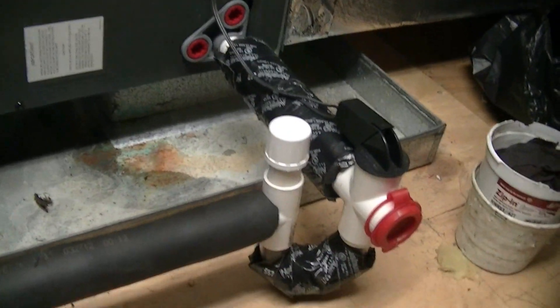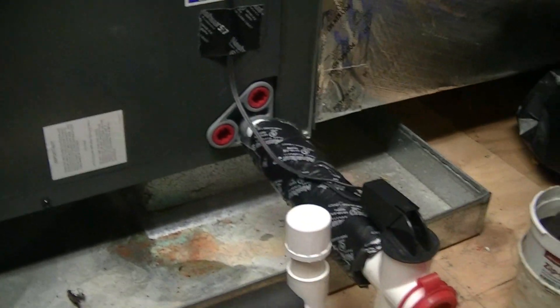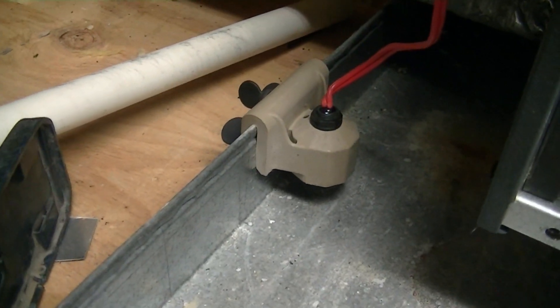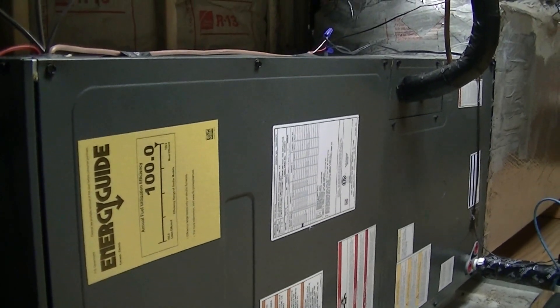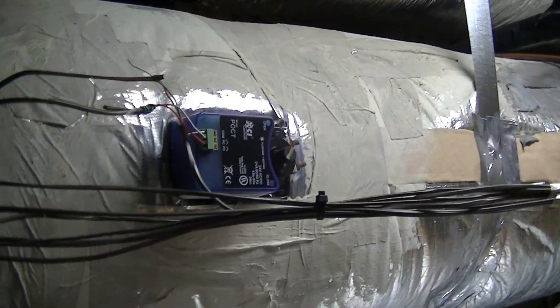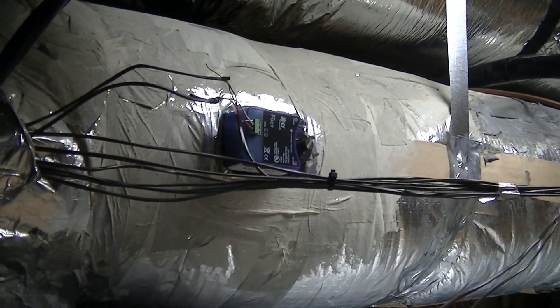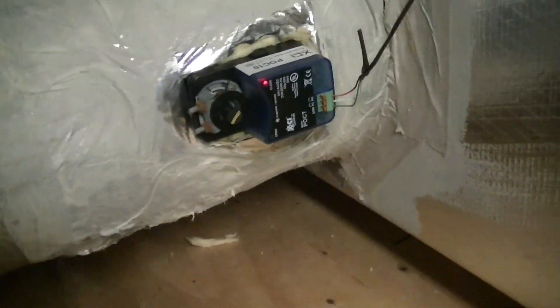Got our drain finished — it's an easy trap. There's a little plunger on the inside that goes up if it backs up and shuts the compressor off, just like a float switch, which we also have. The air handler's all tied in, set up on blocks, the drain's tied in, we have our lines run around. We have our bypass damper motor right there, and there's our static pressure switch. On this older style, you turn the knob to adjust the static pressure sensitivity in the ductwork, and then it powers that motor when necessary to lower or raise the system to adjust the static pressure. Another one of our damper motors is closed — it's cracked so it still bleeds a little bit of air by. And we're all done up here.